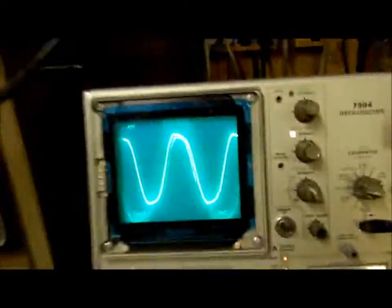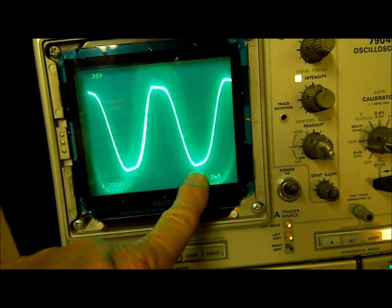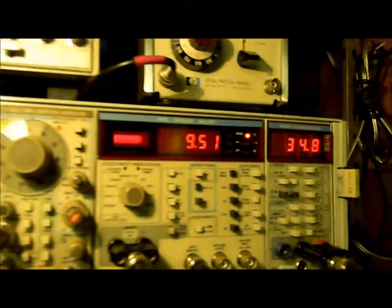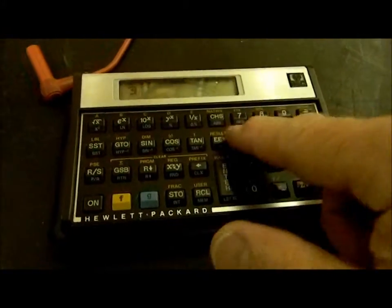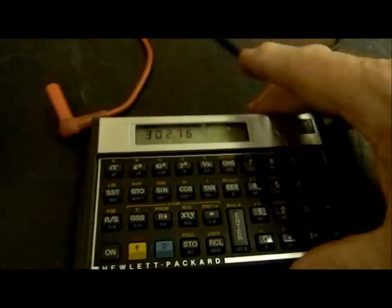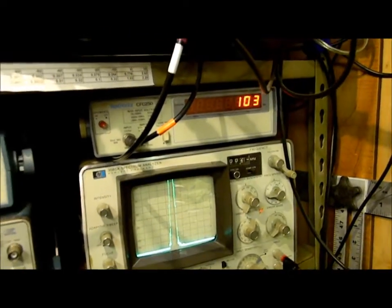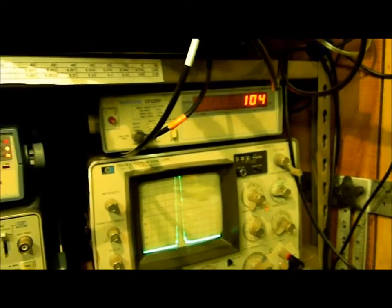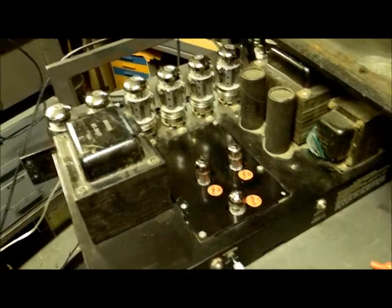Now at maximum output, here's what we get — pretty linear. I've got the same amount of wiggle at the top as at the bottom, not quite clipping yet, less than 10% distortion. 34.8 volts across 4 ohms — that's 34.8 squared divided by 4 — gives us 302 watts. It doesn't look bad at all. I'd say the old amp meets its specs. That's at 103 hertz too, so it's at low frequency. I'm very pleased how this one's turned out — it's turned out to be a real jewel. I hope this helps.